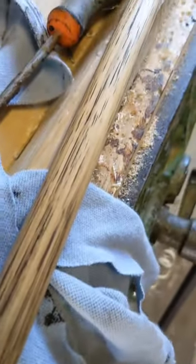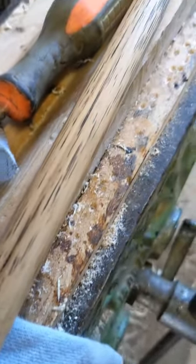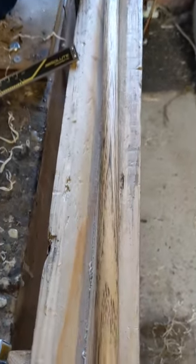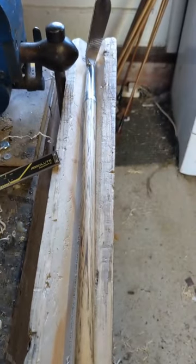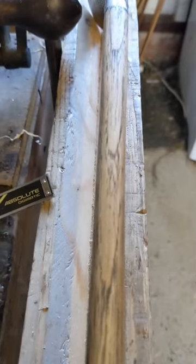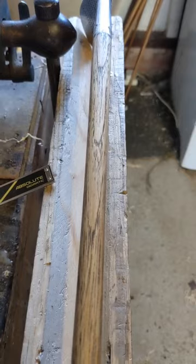But I just thought I'd give you a few close-ups of what the grain is looking like now that I've put some bitumen into it. And what I was saying earlier in an earlier clip was you want the V's. So here you can see a V of the grain. You want that on the top side, as it were, of the shaft. And similarly, if you were to turn it over, you want the V's, you can see three there, on the back side running towards the handle.